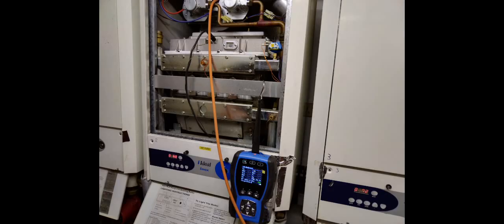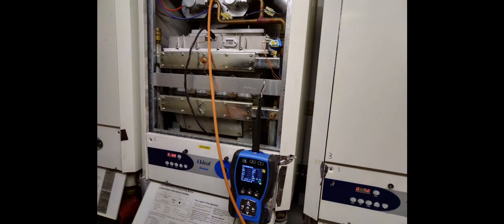When I did a drop test to see how much the working pressure was when the gas valve was opening, it was quite low — the pressure was dropping when the gas valves opened up because they open up at the same time on this unit; they operate together. I checked both gas valves and I think it dropped to 24 millibar, but that wasn't enough. So the gas valve needed to be adjusted a little bit more.